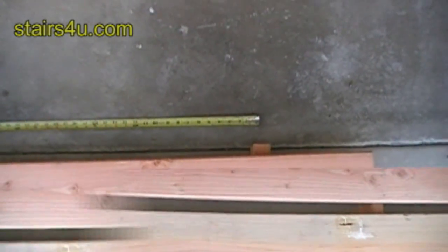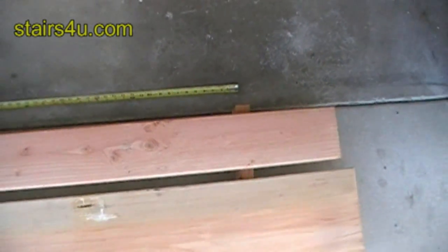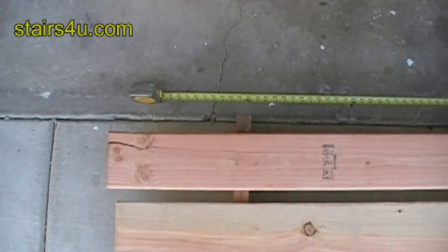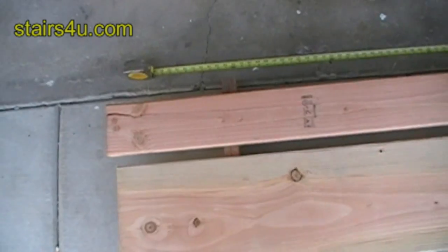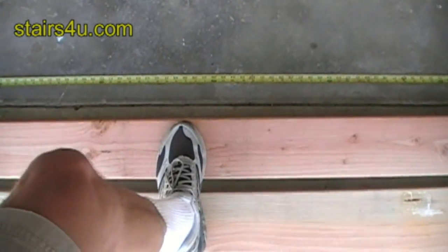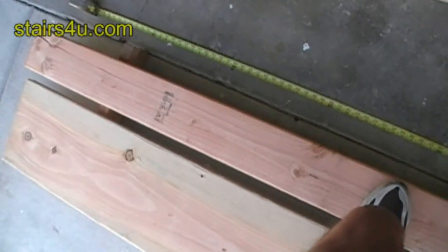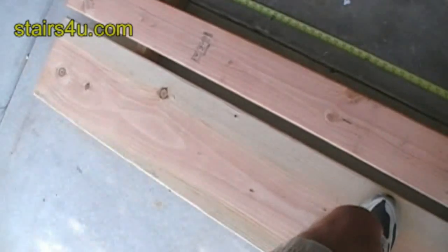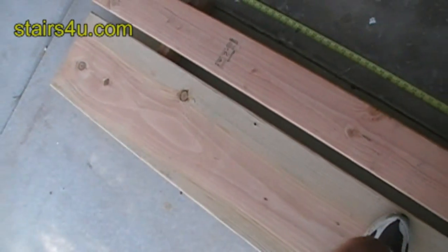So it should give you an idea. Now I spaced it at 6 foot. I'm only going to put one foot on the 2x6 and you can see it moves a lot. The 2x12 is just starting to move.